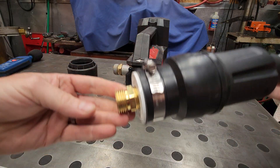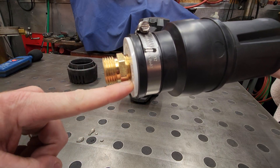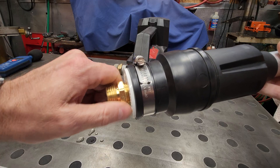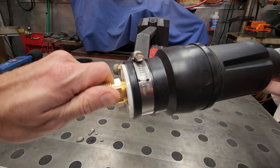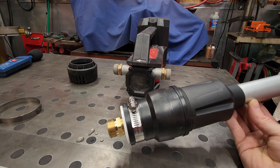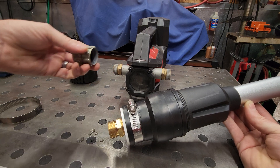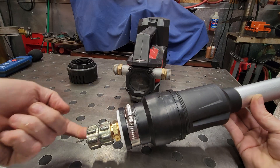In the end of this thing there's a bushing — an inch-and-a-half slip bushing — and it has a three-quarter-inch iron pipe thread interior. So I was able to put this brass male iron pipe to male hose thread adapter and screw it in there. Now I have exactly what I was looking for, which is a male hose thread end. To use my hose, I use these little swivel adapters on this one as well, so I can hook the male end of the hose thread up to the pump. I can thread the male end of my hose in here, and the female hose end I can then hook up to the spigot on my rain barrel or whatever the case is.